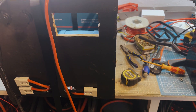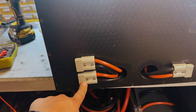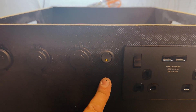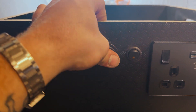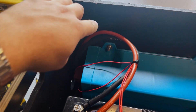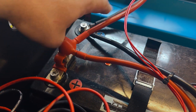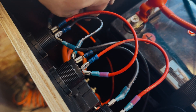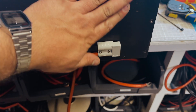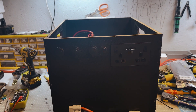We need to know the length for the 240-volt coming to the switch and then we'll connect that up. Here is where we're at — we've got two outputs on Andersons, this is the input for the DC to DC, this is plumbed into the inverter and that all works. We've got a switch here — inverter on/off with a little light — and we've got a couple of cigarette lighters here, both working. I've tested them and of course our USB. Pretty pleased with how it looks.